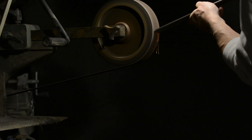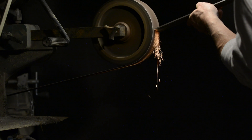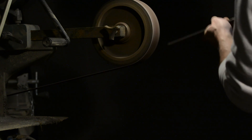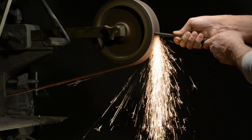Something you'll notice about steels with lots of chromium is that the sparks kind of ramp up. At first contact with the belt, they just throw some very small red sparks. Then, as the sample gets hotter, they throw more sparks. Whereas high carbon steels just kind of explode with sparks at the very first touch to the grinder.